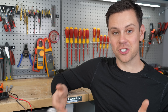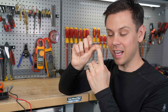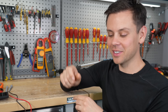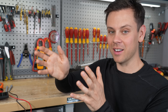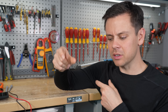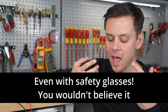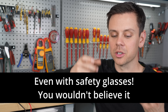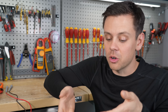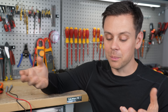Some things can poke you and shock you. If you're working on circuit boards and a spiky piece of solder goes into your skin and into your blood, it bypasses all the electrical resistance of your skin and allows electricity to flow. Be careful of what you're touching and what it looks like — you need to think before touching anything in an electrical device. Also, I've burned my eyeballs many times from electrical projects — solder and other things. Have an eyewash station or eye rinse cup ready. If you burn your eyes they'll be sore for a few days; always check with a doctor. Get good at rinsing your eyes because if you work with electricity, you'll eventually need to.